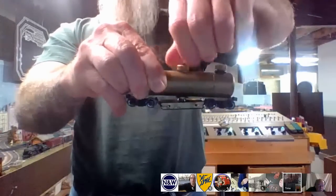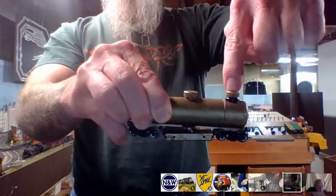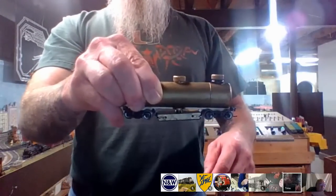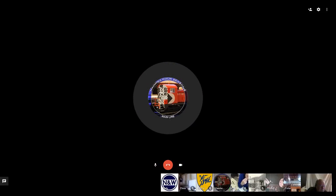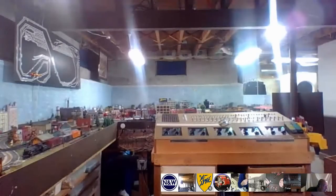But it's not hard. All right, now how do you do it with DC? Oh, in DC? I don't know that you can in DC. In DCC you can real easy, but I don't know that you can in DC. There's no jumper I can put on there to disable it? No. There's no jumpers or anything. It's all programmed in DCC. Maybe, I don't know this, but maybe if you took your locomotive to a local hobby shop or to somebody's layout that had DCC and you programmed the locomotive with the correct back EMF settings, it might run correctly on DC then, but my opinion is it probably would not.